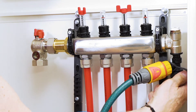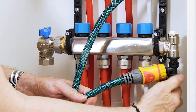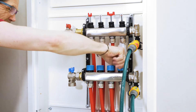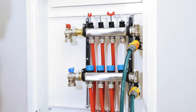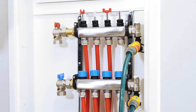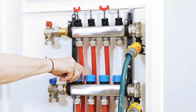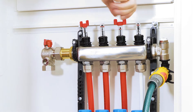Once you've turned on the water, screw the lids on the fill valves, which allows the water to circulate. Open the lid for one coil at a time from either side, let the water run for about five minutes per coil, and repeat until the whole system is filled. Make sure the flow indicators aren't closed.